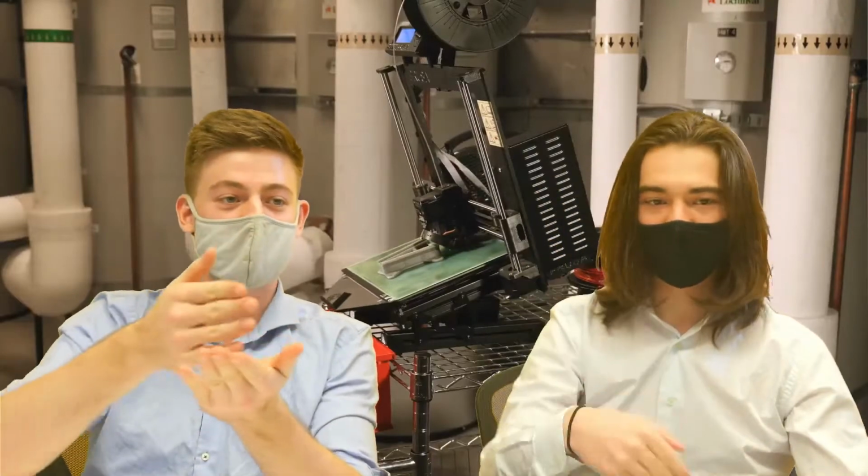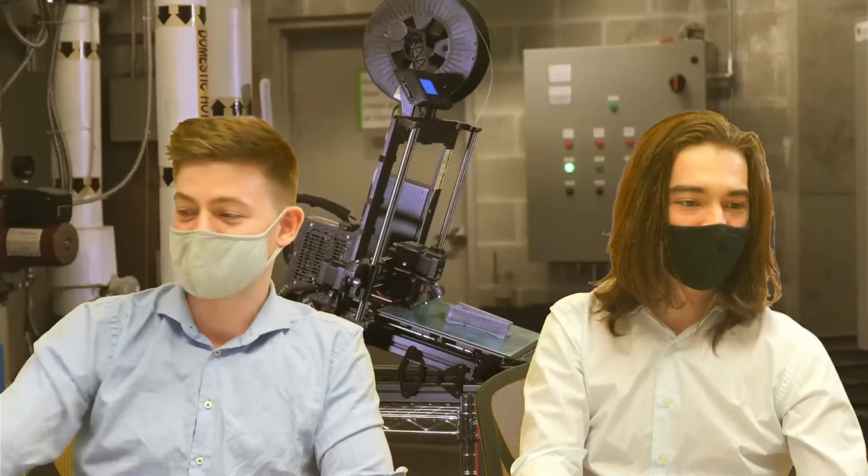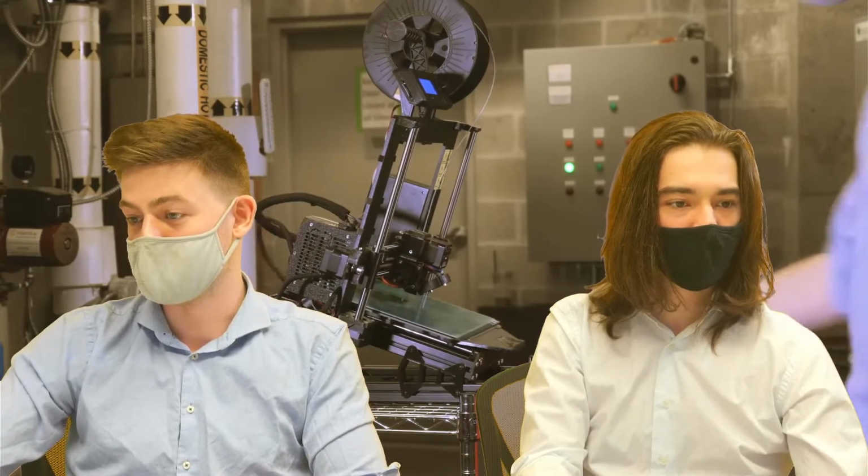Yeah, the extruder input hole. Here's the picture. Plastic Ender arms always fail that way. But this was with a brass bushing inserted, because they used to fail really quickly, but it actually cut completely through the brass, which I did not expect. And the weirdest part was it happened over the course of like three weeks. It wasn't a typical Ender extruder crack. It was literally sawing through the brass insert and then the plastic underneath, like a bandsaw. I don't know if I have a picture of that, but I found a picture of another really weird wearing out case.